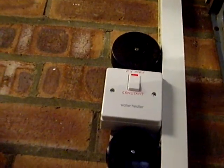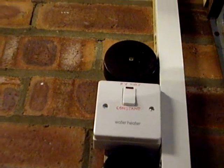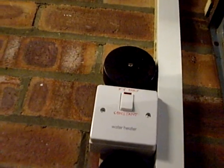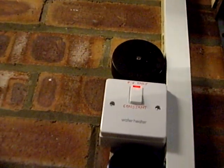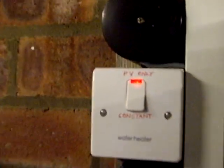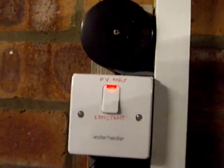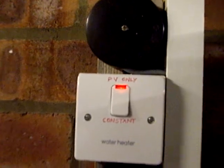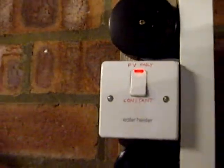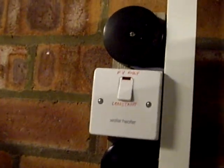Every time I switch it off the energy bucket empties, so it takes a while for the flicking to restart — there it goes. If I put the fire on more — that's a three kilowatt heater — we've now got three kilowatts coming from the mains being recorded twice going back out through the CT. The difference between the three kilowatts coming in and the surplus three kilowatts going out is three kilowatts, which should be enough for our immersion heater. So it's pretty well on continuously — that's a fairly good demo that the Mark IIa is indeed doing what it says it does.